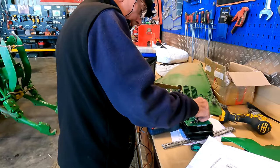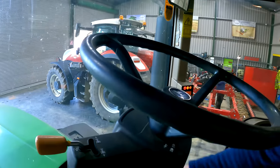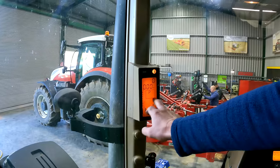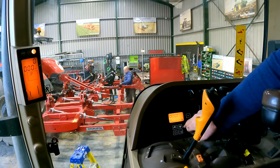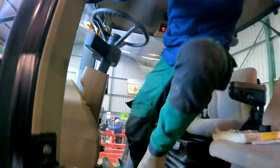What else, Mick? I see you with the floor up here. There must be something. The fuel gauge is not working. Initially, when we turned on the ignition, we only had a very faint light up at the top, and none of this bottom section was lighting up, as you can see now it is. Over here as well, this was completely faded. They took out this unit and put the bulbs in the back of it. The only thing is we think the fuel sensor has gone on it, so that's what's missing there at the minute. It's reading flat out.